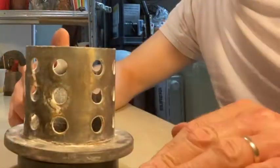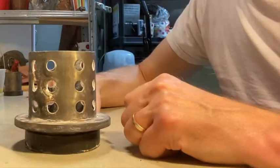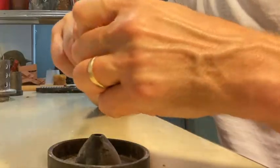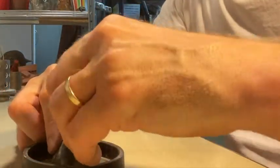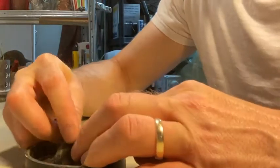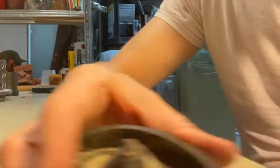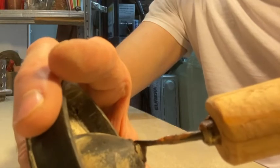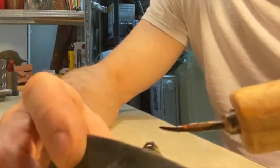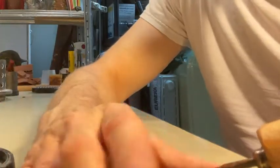We'll put tape around it too to seal it. If I have a wax piece there, I can carefully lay the flask over the top. You want to make sure you're not going to knock all your venting or your piece over when you do that. I can clean this up a little bit and use the soldering tool to kind of seal along it. I can also take some round vents and shove them right into that little hole.